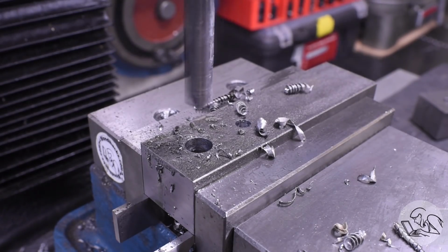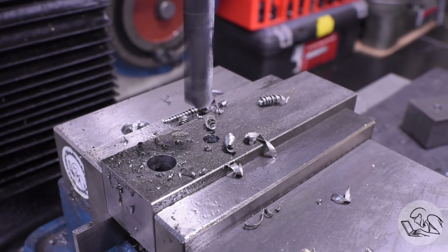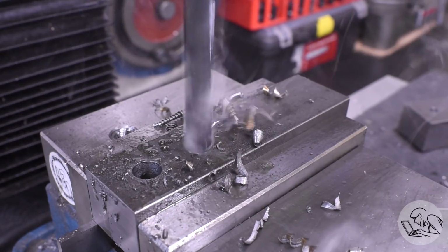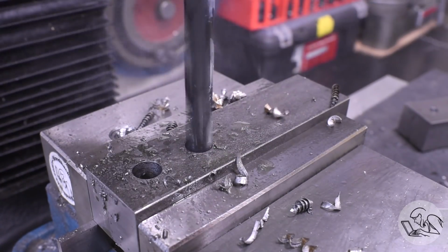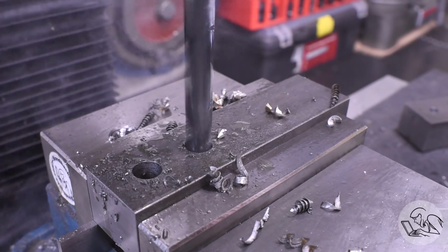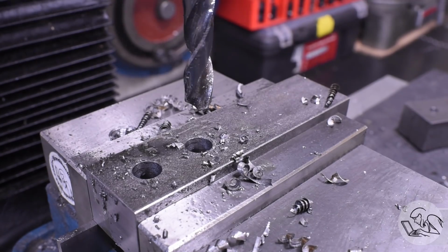The guide holes are going to have to go 1 more drill size up yet, but because this is 4140 and it's pretty tough cutting for my little mill, it doesn't hurt to have an intermediate size there between the pilot and the final drill. Look at all the smoke. You can see how much heat this stuff makes when you cut it. That is some tough steel. It's good stuff.